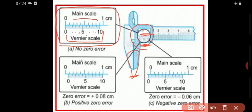You have 10 divisions on the vernier scale. If you notice closely, these 10 divisions of the vernier scale are actually coinciding with 9 divisions of the main scale, as shown in the magnified diagram.